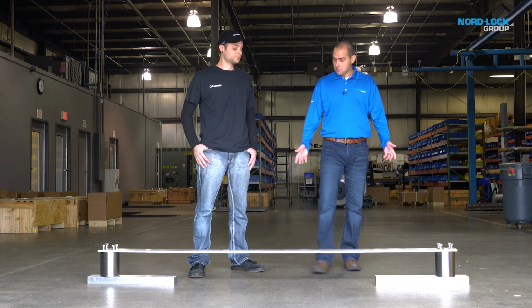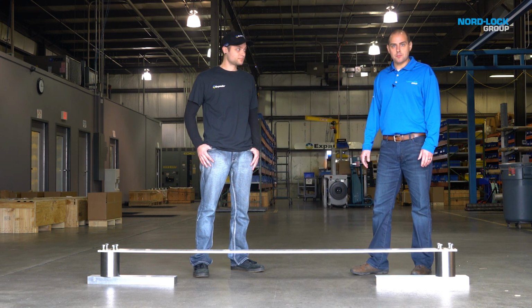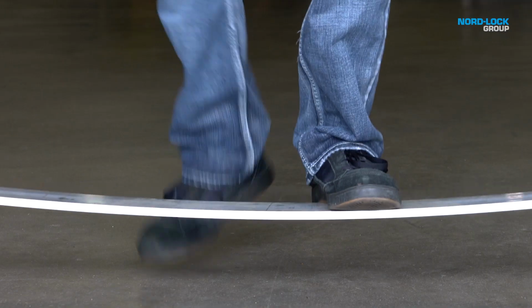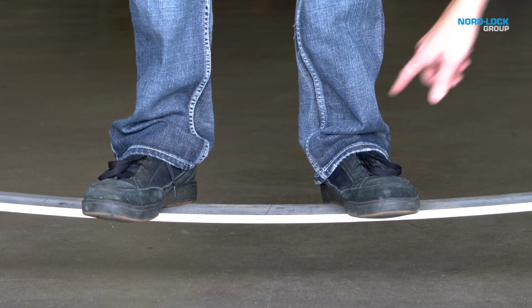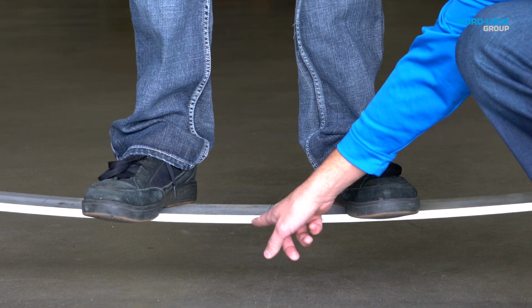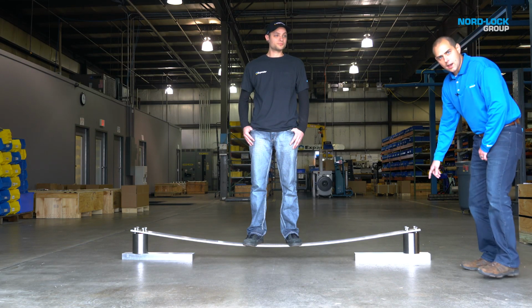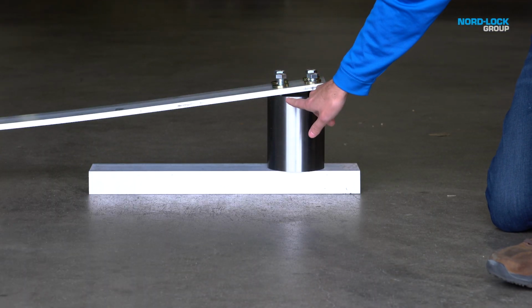So here's an example of a simply supported beam. It operates similar in fashion to a conventional pivot pin. When the beam is loaded, you can see that the maximum stress is experienced right here where deflection is the greatest. All of that force is being held at 2 points, which can be seen here and on the other pin over there.